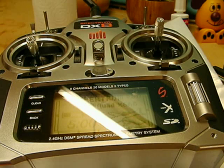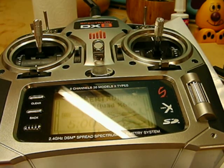One bleep for brake on, two bleeps for brake off. You can only alter one setting at a time with this ESC, which is a bit annoying. We'll run through the other options just so you can see what they do, although I have already set the NiCAD one. So we're going to put the throttle back up. Bear in mind it only works every alternate time, so I'll plug it in, unplug it, and plug it back in again.